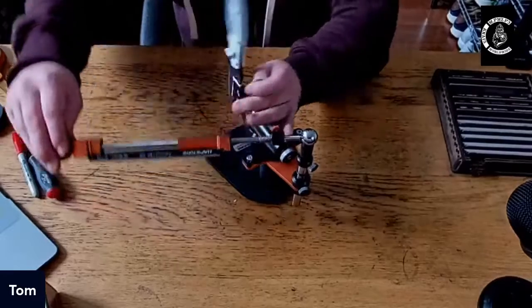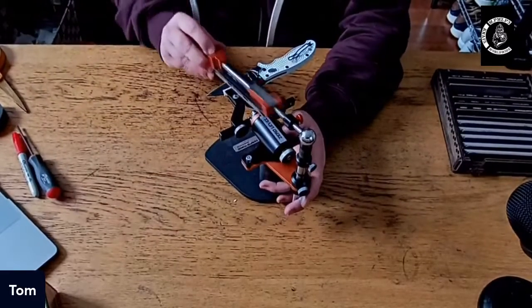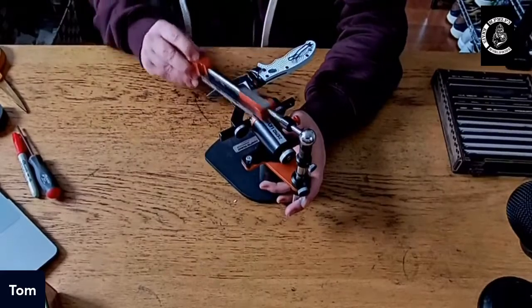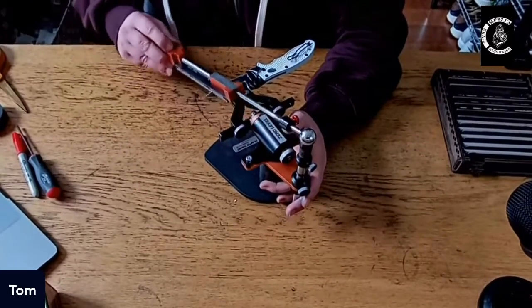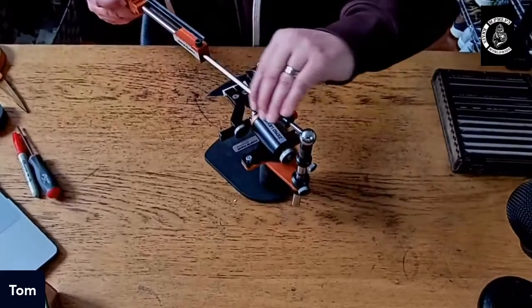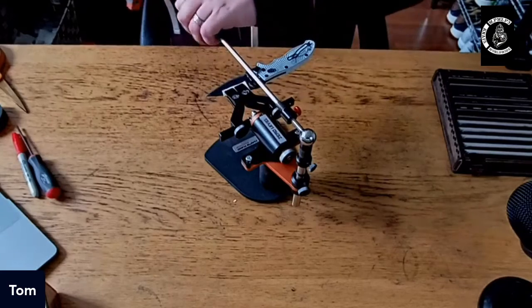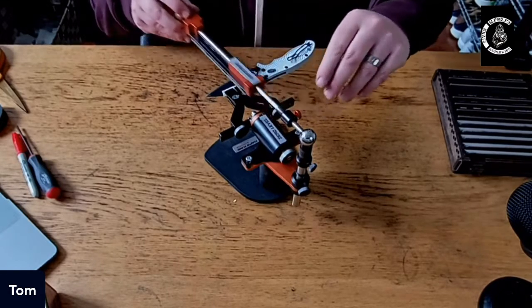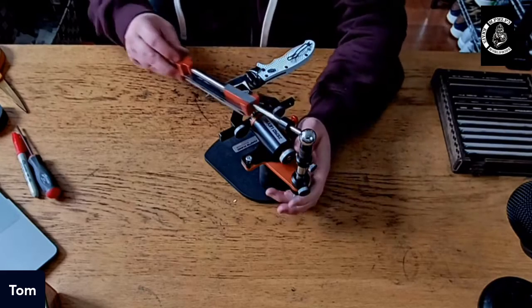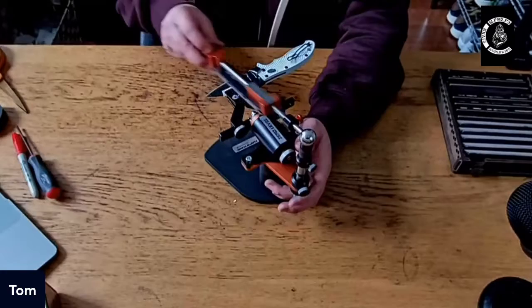Okay, now we're going to flip. So we're doing less time at a higher grit, less pressure. All we're trying to do is reduce the burr. We reduce the burr by flipping back side to side. Hint, never put oil on the rod on your Hapstone RS. It really kind of gums it up. I tried to oil this thing to lubricate it, and it made it kind of sticky. So don't do that.